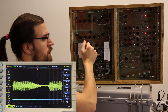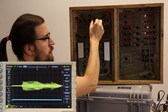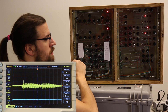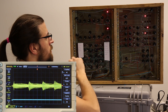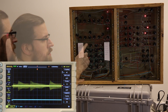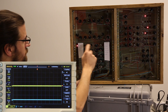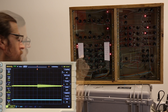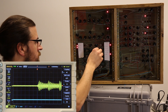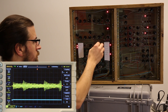These envelopes have eight control points that give non-linear control to me. The first one is for amplitude, while the second is unassigned. It sounds okay like this, but I do have the modulation working, so I'll apply the other envelope to the filter and add a pitch LFO. After tuning some parameters and adding a bit of glide, we're getting something that sounds good, and would be a very low cost to deploy as a fixed synthesizer.